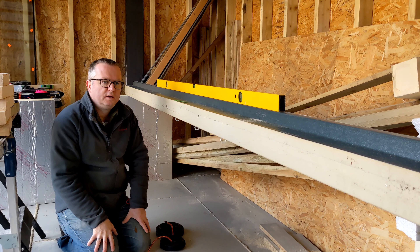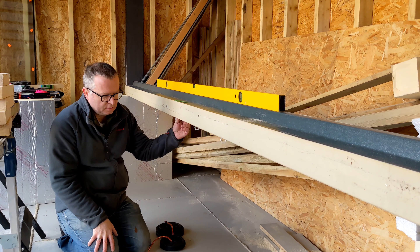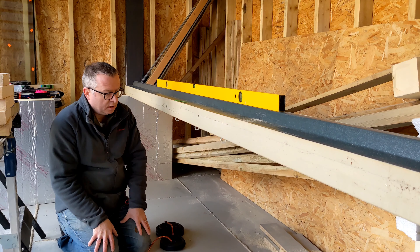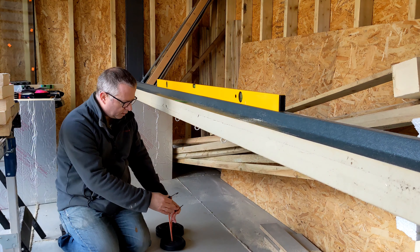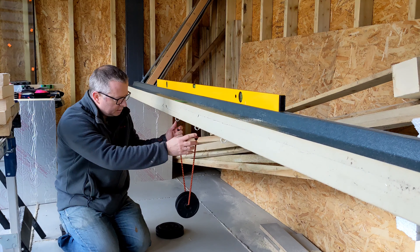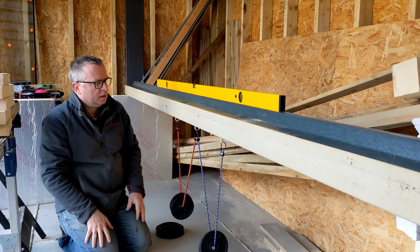I've calculated the weight of the plasterboard, plaster and the battens: it's 5.5kg per linear metre of batten if you've got 12.5mm plasterboard. If you've got 9.5mm plasterboard it works out about 4.4kg per metre — that's what the thing needs to carry. The hooks are spaced out half a metre, so that's 3kg over half a metre, or 6kg over one metre.